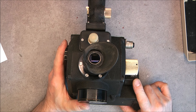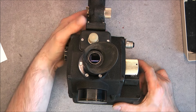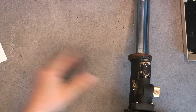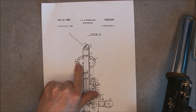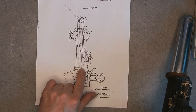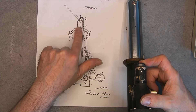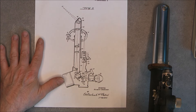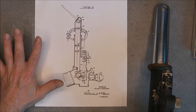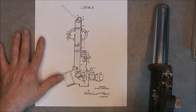The idea is that it is mounted in the ceiling of an aircraft, with this part poking out, and you will aim at a star for a defined amount of time. You will measure the angular deviation of the star position in two axes. This counter is one axis, and there will be a scale mounted at the top with a compass dial for the other. You will measure how much you deviate in this direction, and somehow with this information you might be able to know your speed and direction, probably with the help of tables.